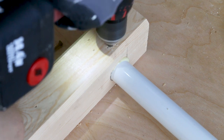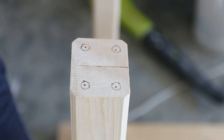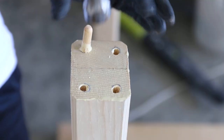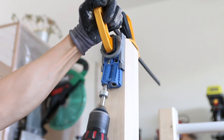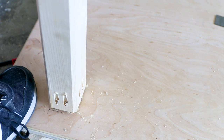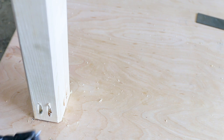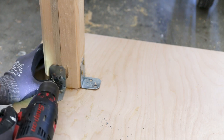The base was 3/4 inch maple plywood and the legs were 2x6 legs cut in half and glued together. I used 1 and 1/4 inch steel closet pole rods as the bars. To secure the legs in place I used wood glue, pocket screws, wooden dowels, and metal brackets. To secure the metal bars I drilled a hole into the side of the leg and used a screw. I also made a farmhouse-style end with an X design for both aesthetics and strength, then used a router to round over any sharp edges, and stained the entire project with Danish oil.